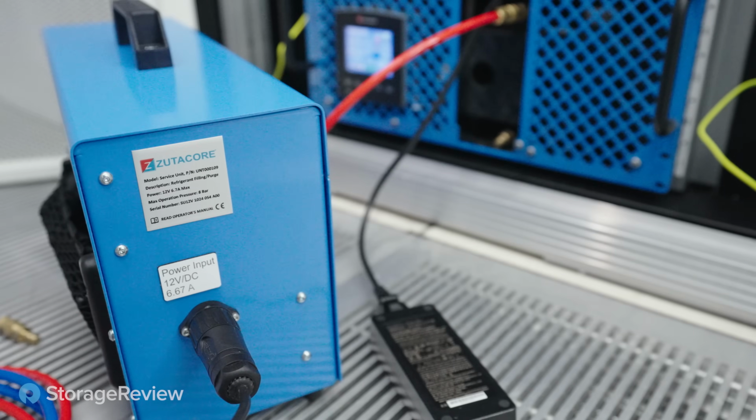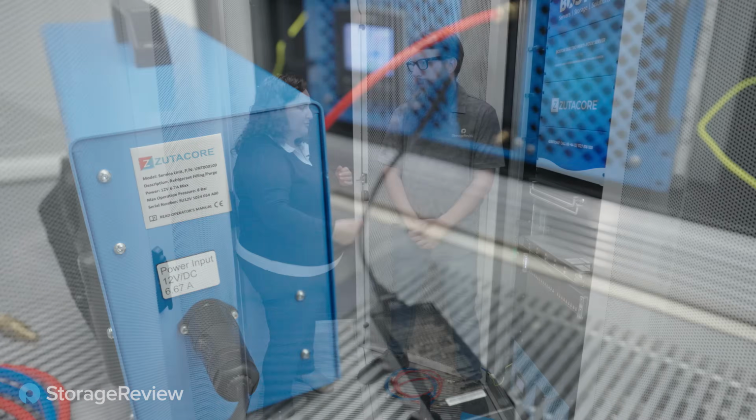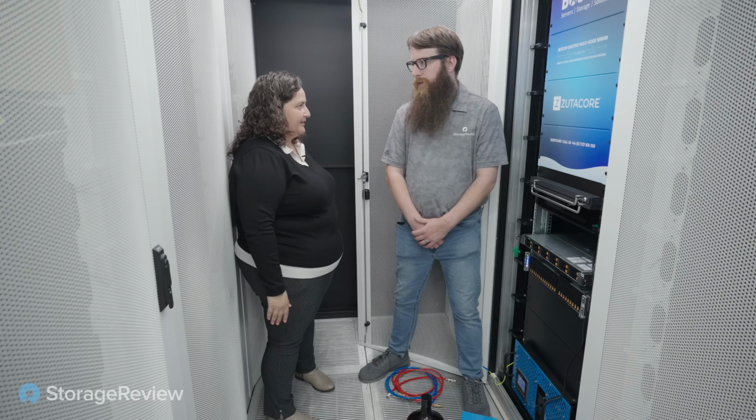It just has a pump, a buffer, and a small radiator with a fan as a condenser. What I did is, after you turned on the stress test, in order for some boiling to occur, we're basically trying to push the air into the buffer. Then we're purging the air out of the system and into the buffer, into the refrigerant tank, so that no vapor or liquid will go into the atmosphere or anything like that.